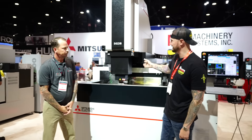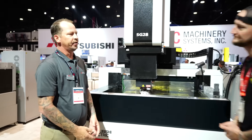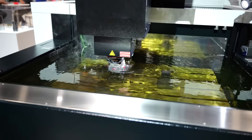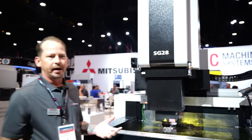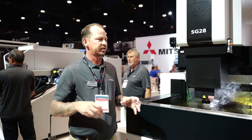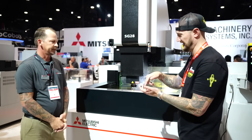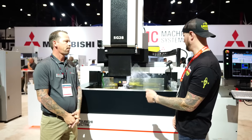I'm seeing a lot of smoke pop out of this thing — tell us a little bit about what this machine is and what makes it special. So this is a sinker EDM machine. What it does is it takes a graphite electrode, or it could be a copper electrode — it'll burn anything metallic. So we make a reverse of the image and then we burn it into steel. Anything injection molded — we're going to be able to put small cavities in, sharp corners, that sort of thing. Very big for the die and mold industry.